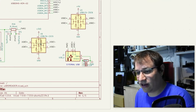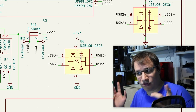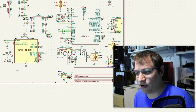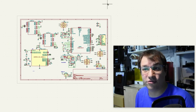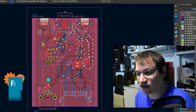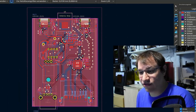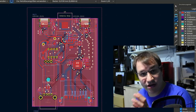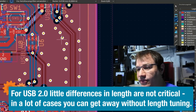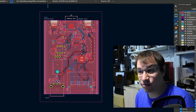My current circuit is not the best one — it's not the newest parts or anything. It's just a circuit I found online for current regulation that seems to work fine. The main point is to find out if current regulation at all is sensible for a USB hub for testing gadgets safely. I still use ESD protection circuits on there, even though I route them like they don't do anything — just to have those footprints as possible test points and to be safe about ESD problems. In the finished design, all power traces are a lot thicker than the others. Signal traces all have a standard thickness. The only things I made sure of are that the traces can carry all the power they need to provide, and that USB lines are routed in differential pairs — not just anywhere. I also added some ground vias so they are a bit shielded.